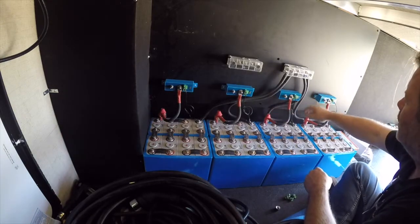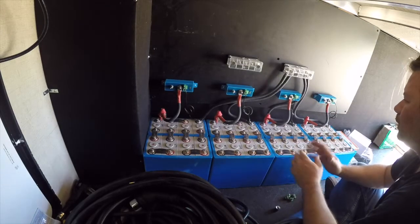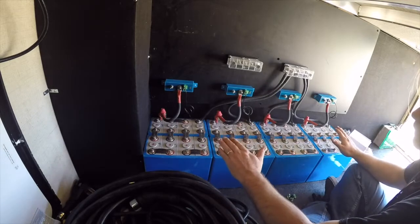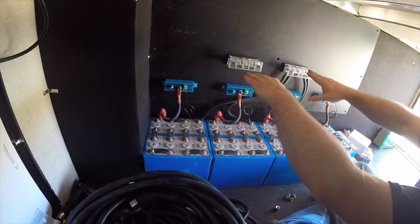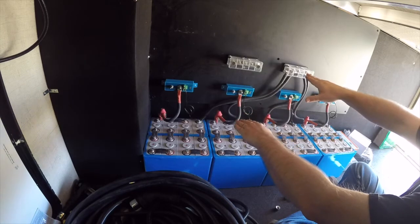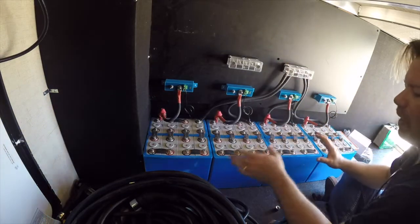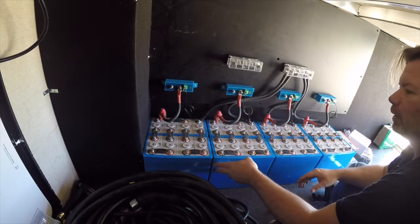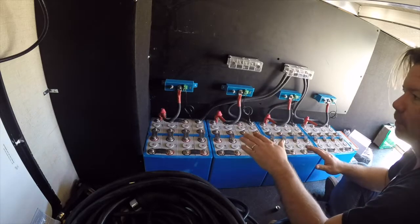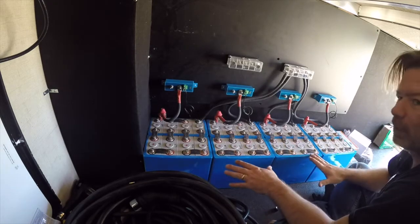These cables are not cut to a perfect fit — they're all cut to be the same size. Electricity is like water: path of least resistance. What'll happen is the battery with a shorter cable will drain faster, and it'll take a charge faster too, so it cycles more quickly. You end up going through more life cycles on the battery with less resistance or shorter cables. We definitely want to avoid that — we want these to drain down and back up at about the same rate.